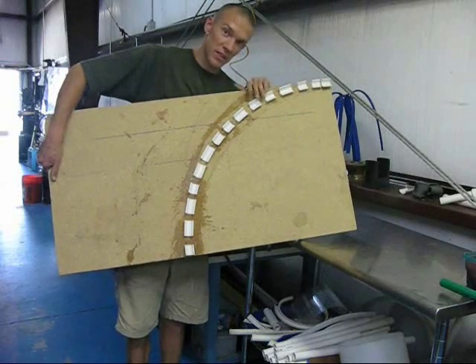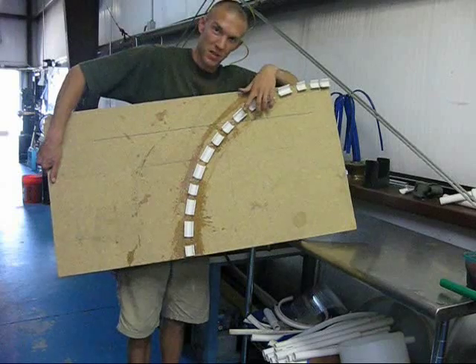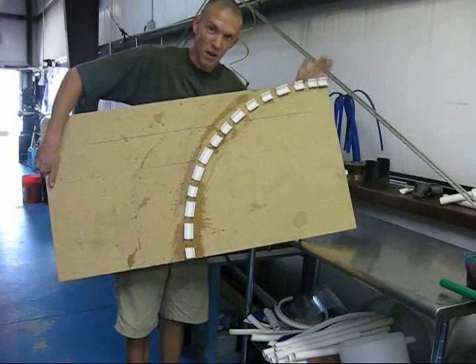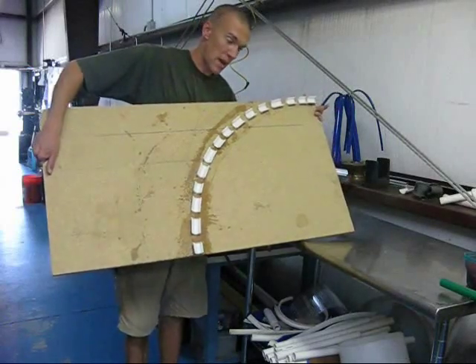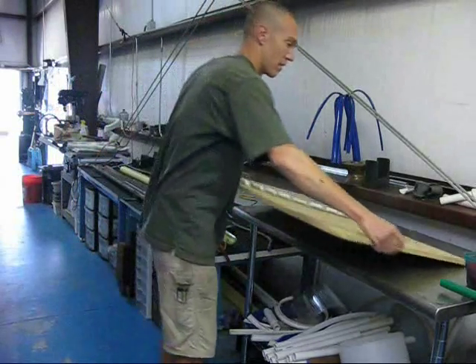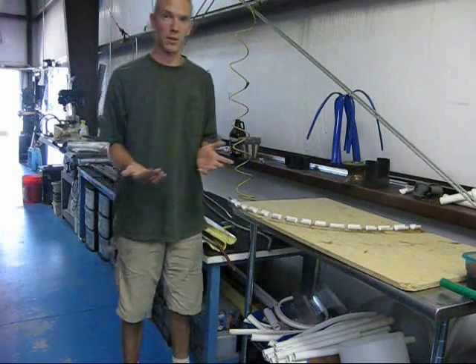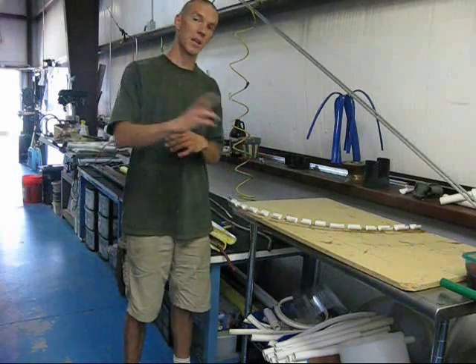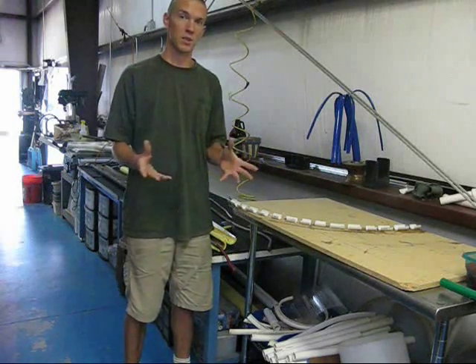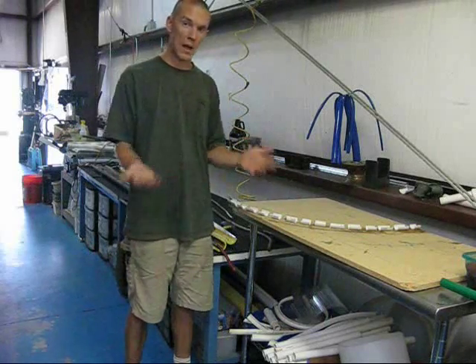The PVC chunks are cut into small pieces and hot glued onto a form. We used a handmade large compass to make this arc, and then just glued the pieces down along the line to make sure it was right. This particular arc was designed for a self-watering greenhouse, but that's not too important — we're not actually going to use it for that. This is really just to show the principles of forming, how to use the form, and why it's an advantage.